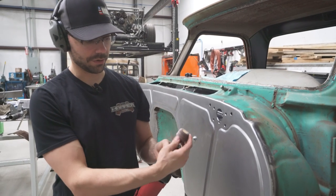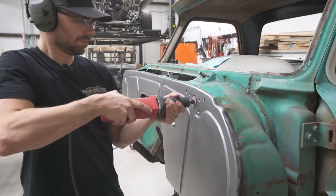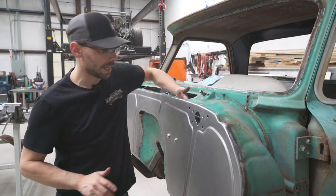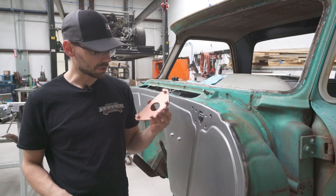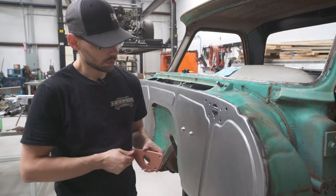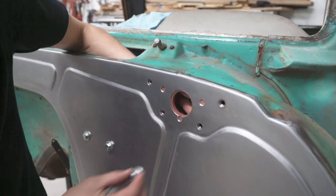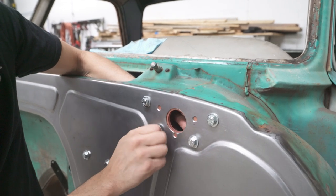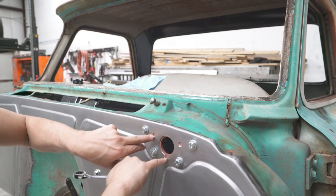The bit's not as sharp as I thought. I've got a flapper disc on the grinder — 60-grit pieces of sandpaper glued together — and we're going to use that to clear the burrs out. Now we're ready to put our pad on the inside, bolt it on there, and plug weld those holes. We've got our backer pad all painted up with copper-rich weld-through primer.